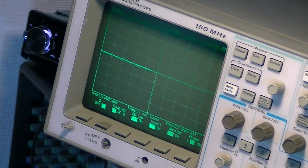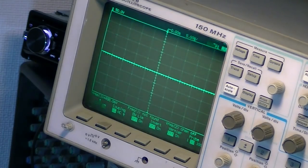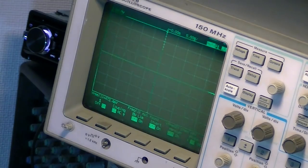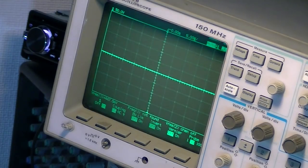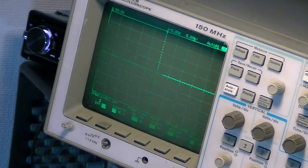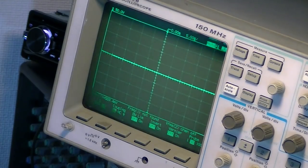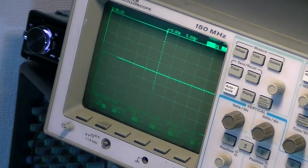And so at this point the capacitors are still charged. I've got to be flipping very careful with my probe. If I touch two pins together that are short to ground, I get a massive spark. Like, I'm talking big firework things, flipping your ears, you get that ringing in your ears when you have a massive pop or explosion, and it's bright as hell, your eyes are blinded and your ears are going pew. And I'm talking from experience here. I've shorted out 160 volt DC on a capacitor rail, and it was not fun.